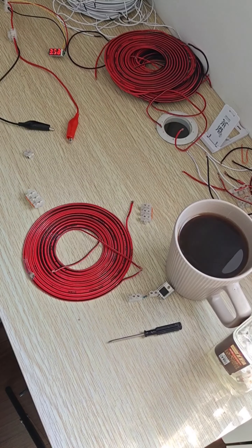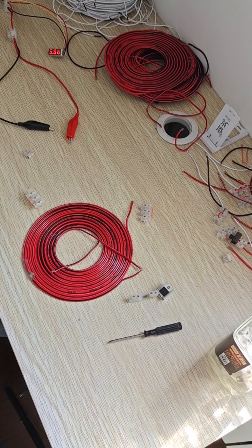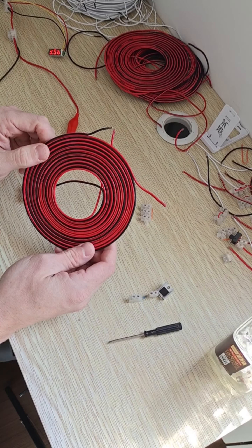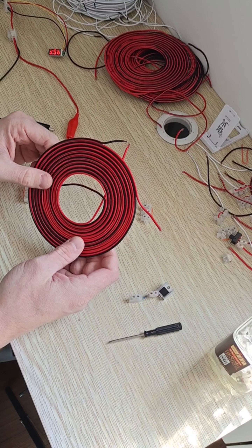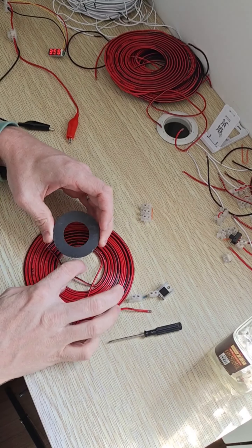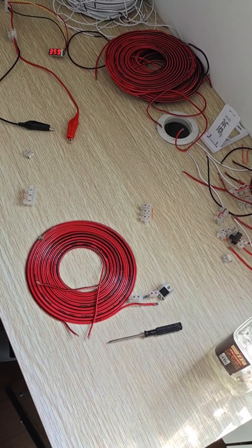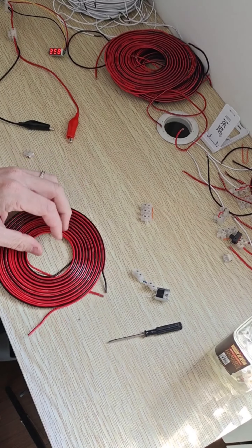Good morning, good evening, good afternoon. So I do a basic introduction to a pancake coil as I see them, how I'm setting them up. I do experiments. Pretty coil which I made from speaker wire — I separated the two wires, measured out three meters, took a round magnet as the center and just wrapped it round on some double-sided tape. There's a hundred ways to make them, but I'll just show you how to set them up basically.